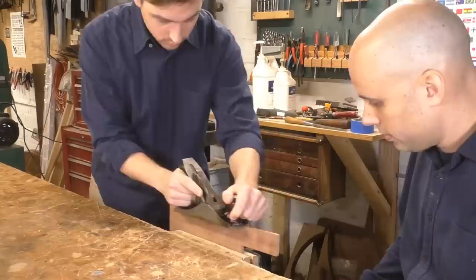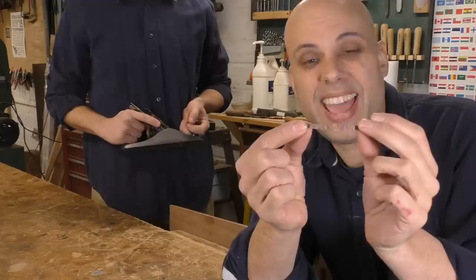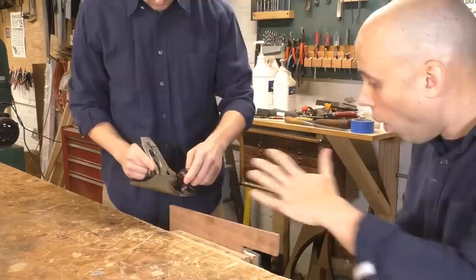Put the plane on a scrap of wood in the vise — this is a little thin scrap of walnut, really useful for setting up your plane. Take a couple of strokes just the way it is with no iron sticking out. Now Nate is going to keep planing the scrap while slowly spinning that knob clockwise, advancing a little bit of iron. What actually came out of the plane? That shaving right there. If you get something like that early on, that's great — an excellent sign.